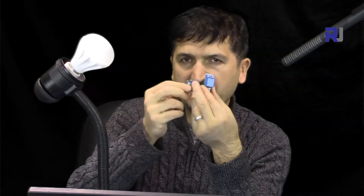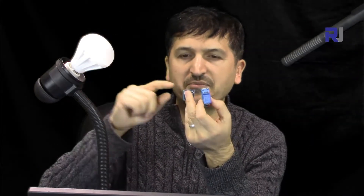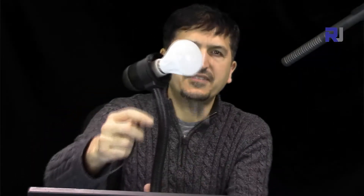Welcome to Robojax. In this video I'm going to show you how we can use the TTP-223-B capacitive touch sensor — sometimes called BA6 — to turn on and off an AC load or DC load using a one-channel relay. We are going to use the touch with the relay and also with Arduino to turn this on and off. These two can work without an Arduino, and we'll also show how to use Arduino to control the amount of time the load stays on.